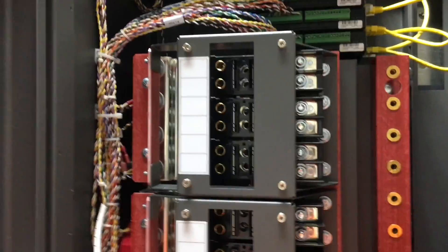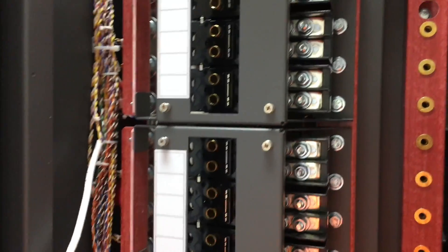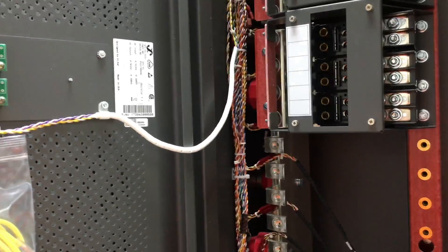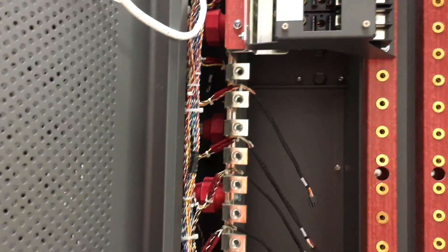This is the distribution panel that will be feeding voltage to different areas and will be able to monitor with some bigger breaker switches. There are sensor leads that will take care of monitoring what's going on. There's also an Ethernet cable, so this will be IP-connected — you'll be able to remotely manage the system. That's what you want on your battery bank and energy storage: a good report from remote, without having to visit the room or site every time to see what's happening.